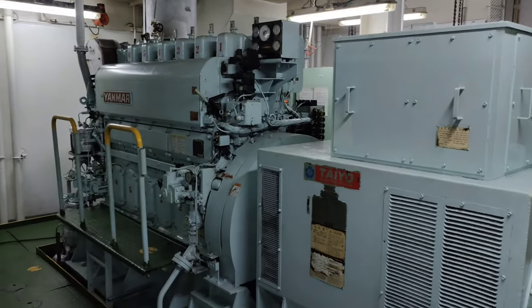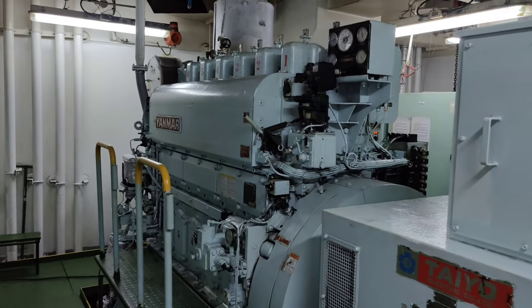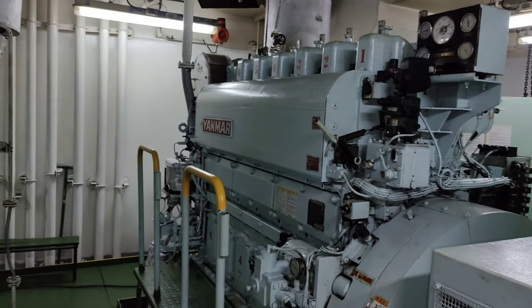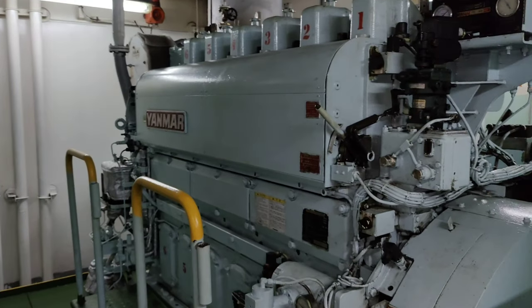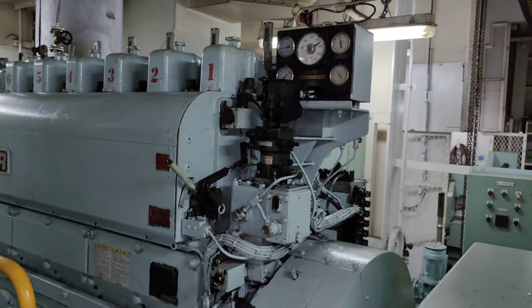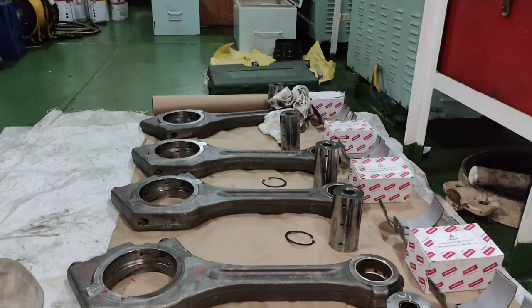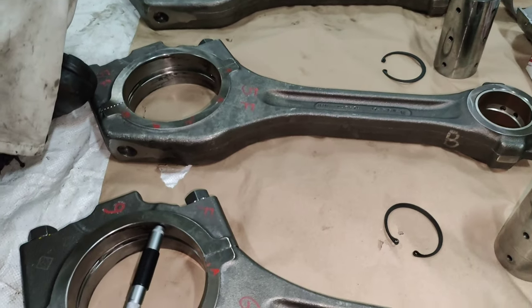In this process of energy conversion, the connecting rod is acted upon by different forces. All these forces accumulate to create asymmetric and dynamic wear and tear of the big-end bearing housing, thereby affecting the ovality of the big-end bearing. Therefore, the ovality of the big-end bearing housing has to be checked on a regular basis during each maintenance.